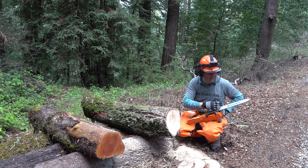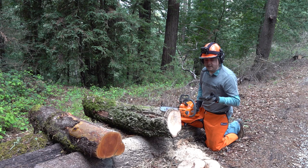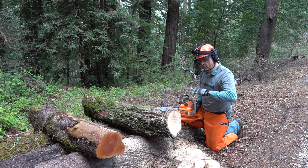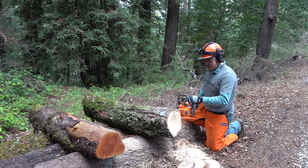Let's see how this performs cutting some oak — approximately 10 inches in diameter — so the 14-inch bar should be just fine. We'll see how well this 5.2 amp hour battery keeps up. I'm going to turn it on without eco mode. One thing I noticed right away is that we don't have as much torque out of this electric motor as we see in the DeWalt 60-volt saw. Performance is closer to the DeWalt 12-inch saw. With this chain it can stall if you crank down too hard — you have to let the chain do the work.